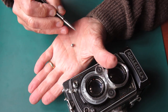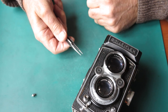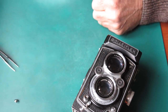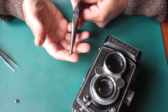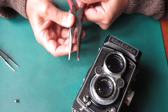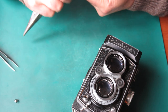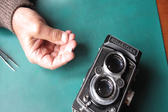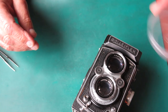If you look at this, you'll see there are two little notches in that screw. Now, how are you going to get that? There are various options — you may be able to get at it with the tip of a pair of tweezers. Doubtless there's a nicely crafted Rolleiflex tool that engages it very beautifully. I got it loose with a pair of needle-nose pliers that have had the tips very heavily reduced to thin blades. I generally use this for unscrewing lens retaining rings. All I needed to do was loosen that screw, and then it spun off with my fingers. You can see some green corrosion on the back of that — that's neither here nor there.